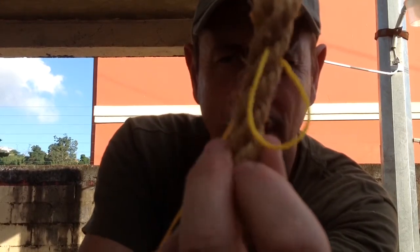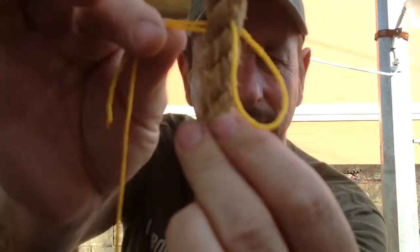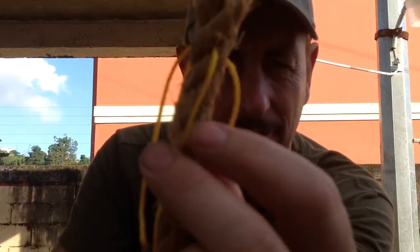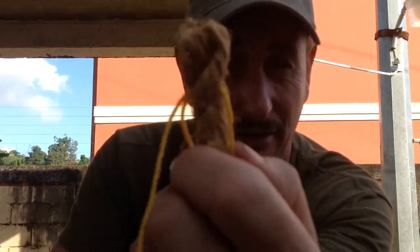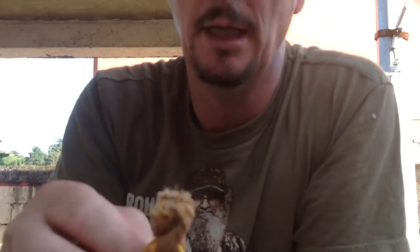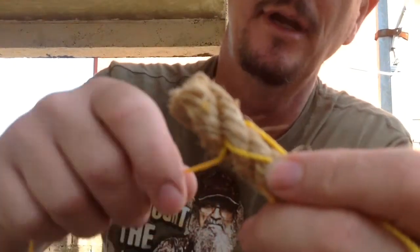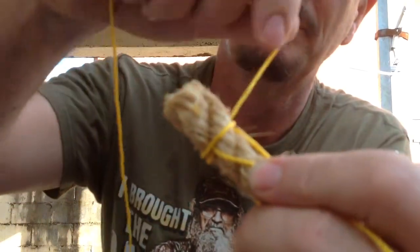one piece either side of one strand, and then you've got two out the other, and you can see that. You leave that loop down, sort of fold it out the way, put it under your thumb, and then you make turns around this end like this. And there's a little ditty, a little poem that helps seamen remember which way to go, and it goes, worm and parcel with the lay, turn and serve the other way.